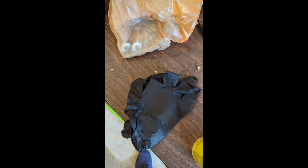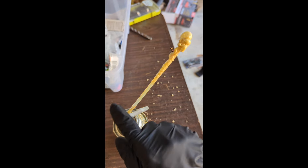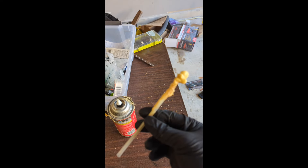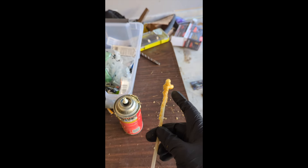We're going to be working with some chemicals, so we definitely want to protect our hands. What I generally do is I like to take this tube part off right here and start with cleaning out this tube. So once you've got the tube released, this dried off foam that's stuck to it will basically just pull off.